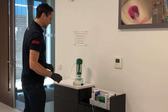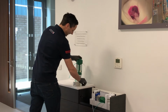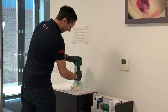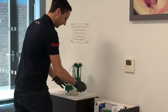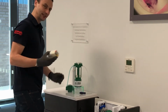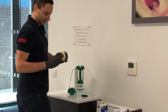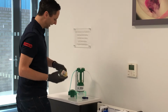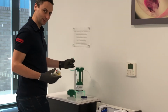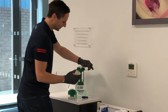So, in order to do this, and I've got a freestanding display here just to explain it a bit more easily, with a flat-bladed screwdriver, you can pop off the cap of the flush valve to reveal the bellows. And if your button is already disconnected, note that the full circle is for the full flush and the half circle is for the reduced flush. Your green tube is your reduced flush connection and your clear tube is your full flush connection.